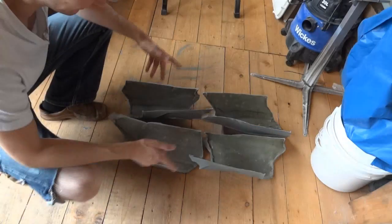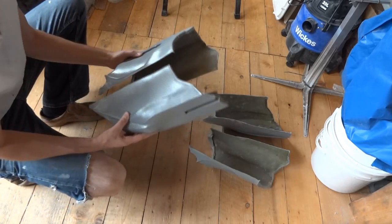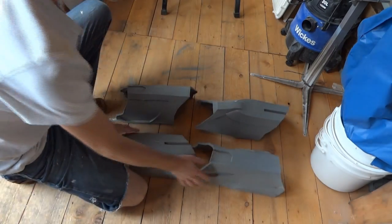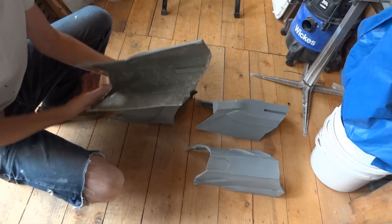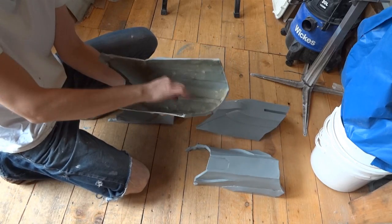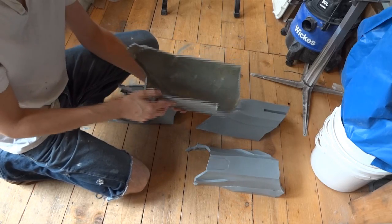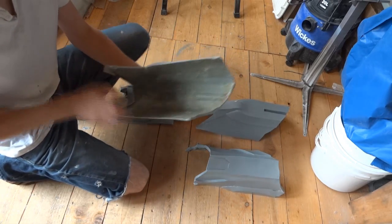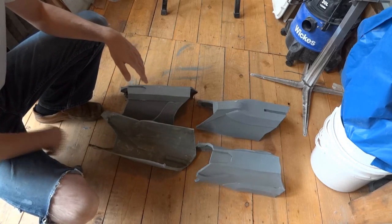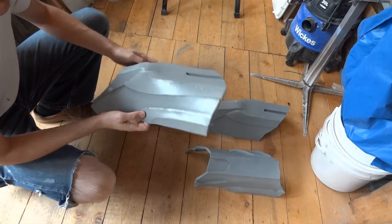Here are the backs and fronts cut up — obviously that's the front and that's its matching back, and that's the other leg. Now it's going to be much easier to do fibreglass reinforcements in here now that it's open — I can easily get my hand in, get my brush in, get the fabric in, and I won't end up with polyester resin up my arm. It's not very interesting watching fibreglass layup so I'm not going to film it, but that's the next thing I'll do. After that I have to do a lot of sanding and filling to sort out these imperfections.